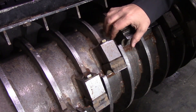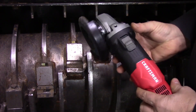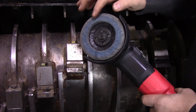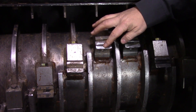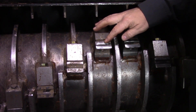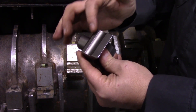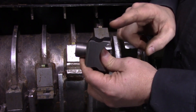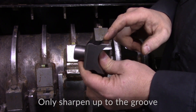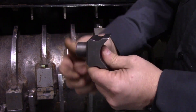The twin chisel can easily be sharpened while mounted to the drum, saving time and allowing you to be more productive. To sharpen, use the same four-inch angle grinder and flap wheel and sharpen the outside edge of the tooth, maintaining the same angle as the original edge. You can judge the angle by looking at the part of the tooth just past the little groove — the groove is actually a depth gauge. Sharpen the tooth as many times as you can, but once you reach the bottom of the groove, it's time to rotate or discard.